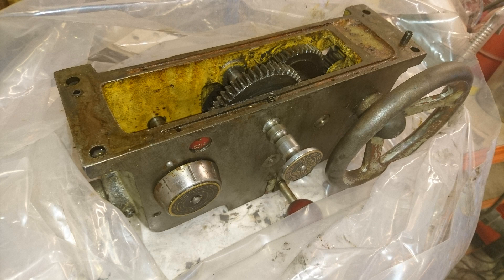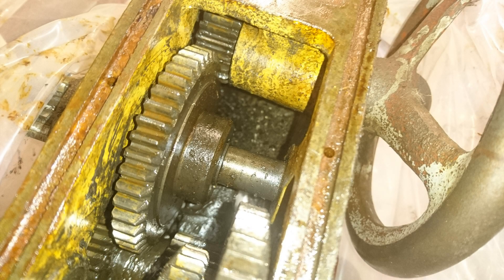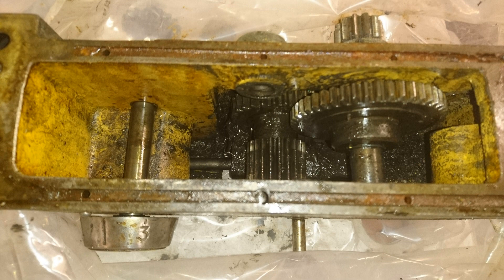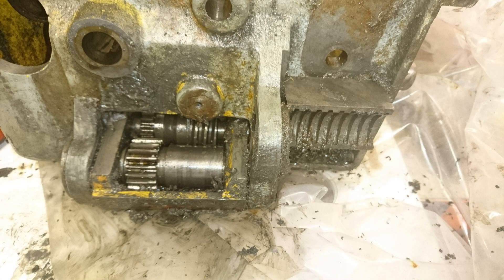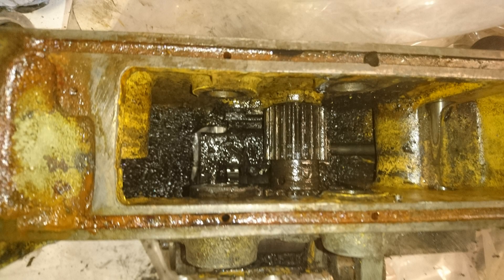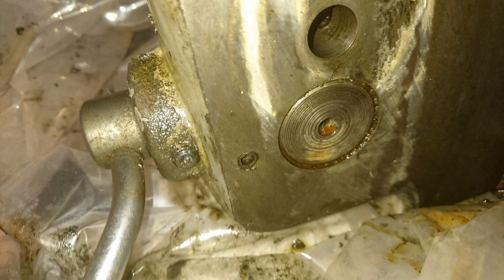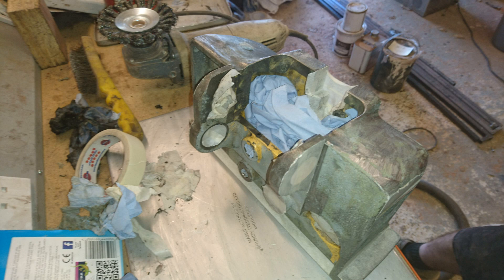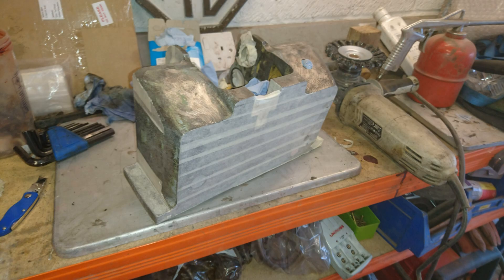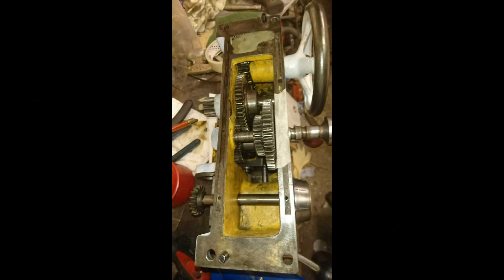I stripped it down as far as I could. This was a fairly complicated component, but I managed to remove all of the gears. I had it placed in an ultrasonic bath — it was filled with swarf. The most difficult part was a section which runs off the lathe's power and allows you to have the mechanical movement of the carriage. There was quite a lot of grime everywhere, but I managed to remove most of it. There's one part you can't remove easily because it has a plug that's hidden — you have to punch it out, and to get to it you have to remove paint and filler. But once I found it, everything else started to come apart, and it all went together quite nicely. I was very pleased.